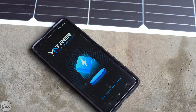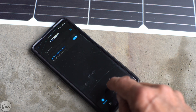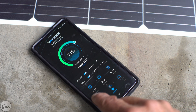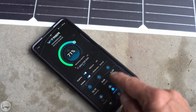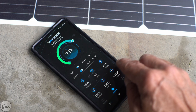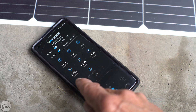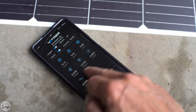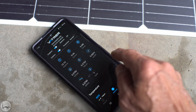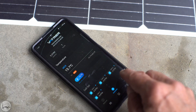Let's open up that app on my phone. It'll show you when it connects — there you go. It's showing my battery at 13.1 volts. Outgoing is 0.0, so nothing going out — zero amps and watts going out. If you scroll down lower you'll get what's coming in, and it's showing an average of 3.274 volts coming in off that panel. Not much going on — it's really overcast. There's the temperature of my battery, and it shows you your different cells.